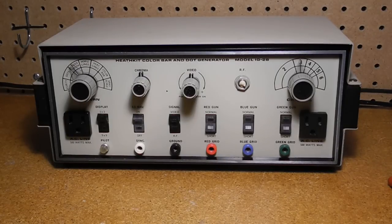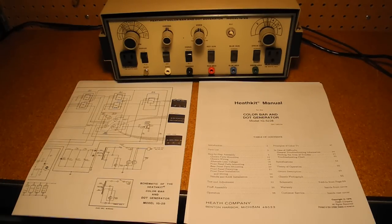It appears to have all original parts and no modifications. The date codes on the ICs are from 1972 and 1973, with the latest being 7345, indicating the unit could not have been manufactured earlier than late 1973. I removed some of the solder flux residue from the bottom of the PCB, as it can sometimes become conductive. I ordered a replacement for the broken RF potentiometer. I tested it using the Commodore composite monitor and Admiral TV used in the demonstration, and it seemed to work fine.